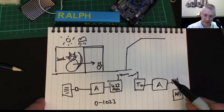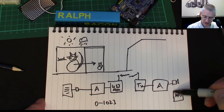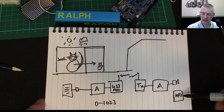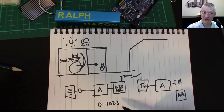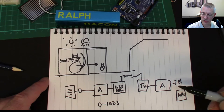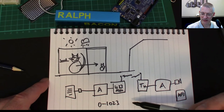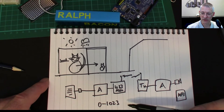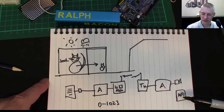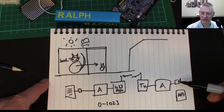This module gives out an analog value from 0 to 1023 depending on how wet it gets - zero is probably like being underwater, 1023 is totally dry. So if the analog value was received inside, the logic could play different MP3 tracks: if it went down to around 1000 that might mean heavy fog - 'mild dampness detected, just check it's not raining'; down to 800 would indicate drizzle; down to 500 means it's absolutely pouring - 'it's raining heavily, please get Benny in and the stuff under cover.' You could also have different beeps and loudnesses.